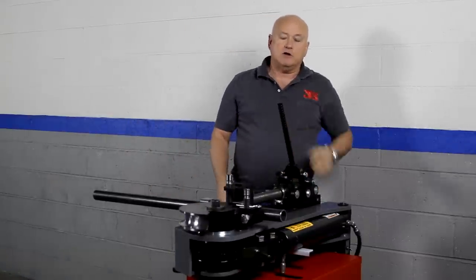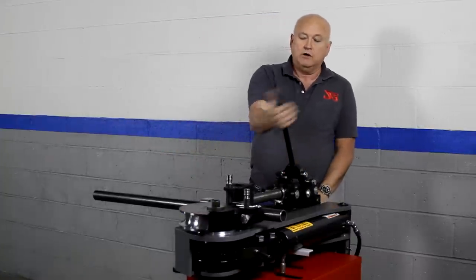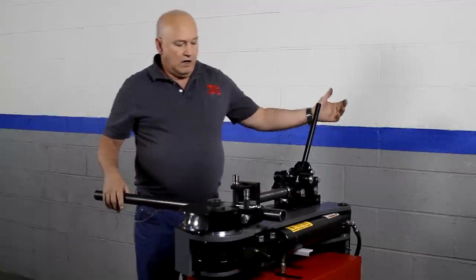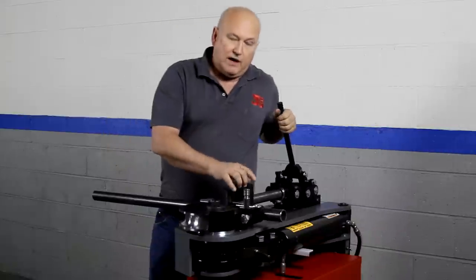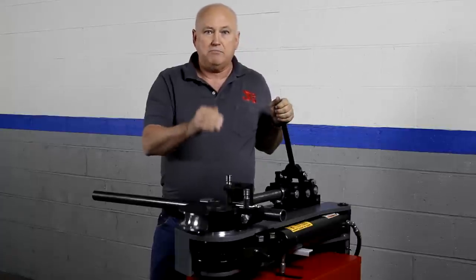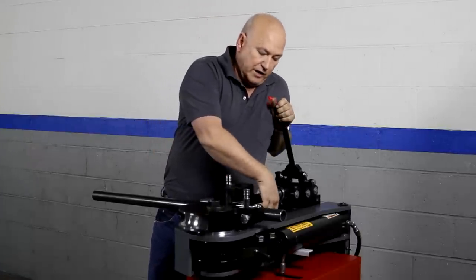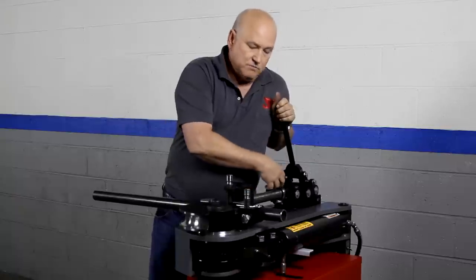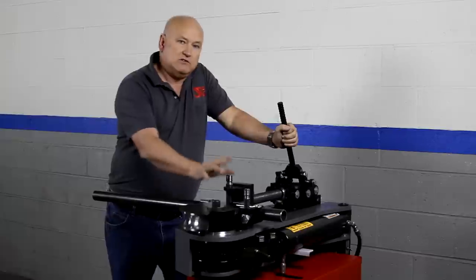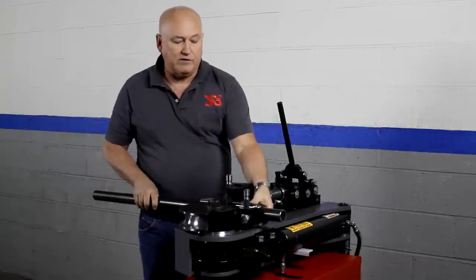Once it looks good, engage the hammer. The toggle mechanism has a safety system that will not allow the toggle to retract during the bending operation; to retract, just push down the lever and pull it back — the tubing comes right out. At this point I record the scale reading; I'm at about 9.05, so I record that. Write it down and you will never have to set it again for the life of that bender and die set. This is your zero point.